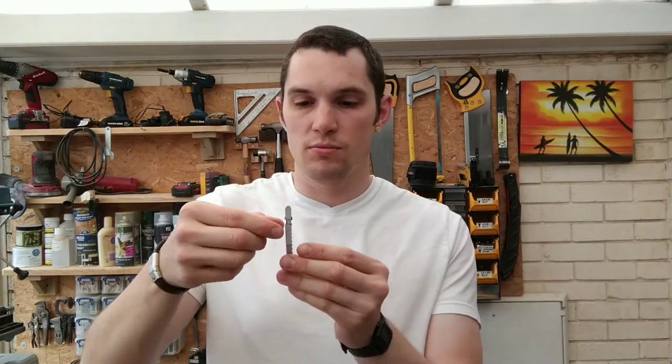You can also get extra long saw blades — maybe an inch or a couple of inches longer — for thicker pieces of wood. However, jigsaws aren't really made for very thick wood because the blade has a tendency to bend slightly, so instead of a straight cut you'll end up with a cut that slowly starts to veer. If it's just for an initial sizing cut where you'll trim it down again later, it's probably not a big deal.